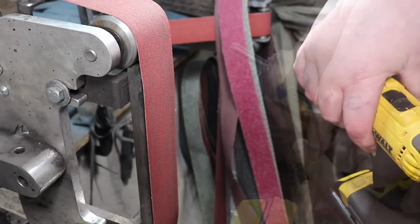I think what I'm going to do now is put it in my drill and take like the 320 belt, the wireless drill, and just put it in one side and zip it with the grinder. And that way, you know, I get these ends hollowed down, so when it goes in, they'll be hollowed down because they're being sanded off down to the handles anyway. So if I just dome the tips a little bit, that way they'll slide in and then I can pound them in and be a much smoother connection for everything, hopefully. Alright, here we go. Pin 1.